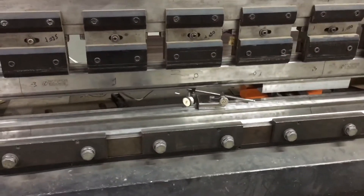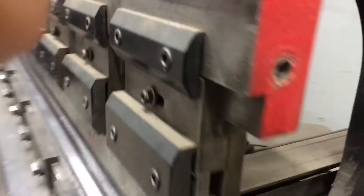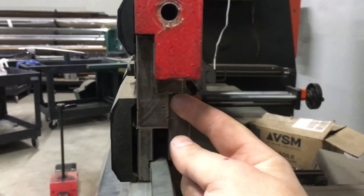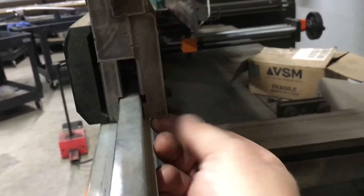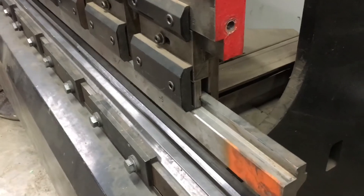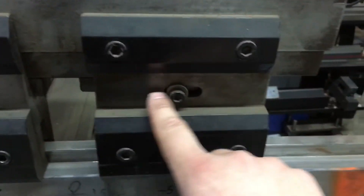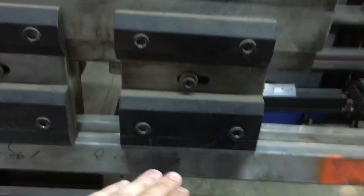Only proceed after everything has been cleaned, and unless you've done it before or been shown how, this video isn't telling you how to adjust — it's just showing you how to check with these tool holders. Everything is pushing on something else: looking at the side, this is pushing into this wedge that's pushing into the ram. Nothing works off clamping force alone, so you have to make sure these are nice and clean and seated. To adjust, this bolt here holds a wedge in the back — keep these snug and then tap on the wedge and it actually pushes this down.